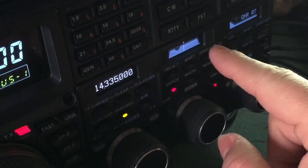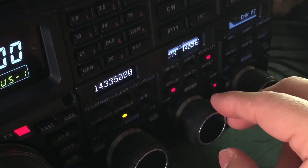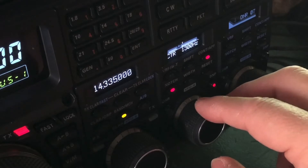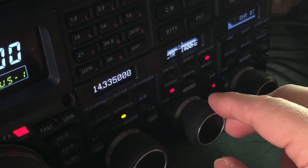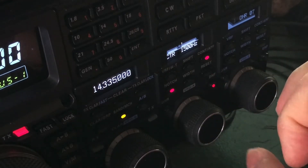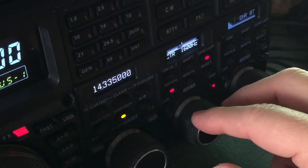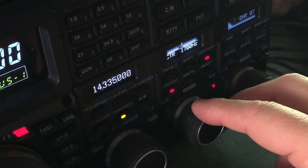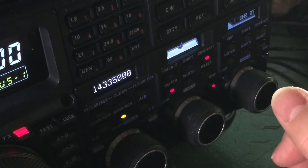You can see the contour is like a wider version of the notch filter. I reach over and sweep through until I hear the most of their voice and the least amount of noise. Somewhere in the 1700 to 2300 Hz range is often the sweet spot for that.